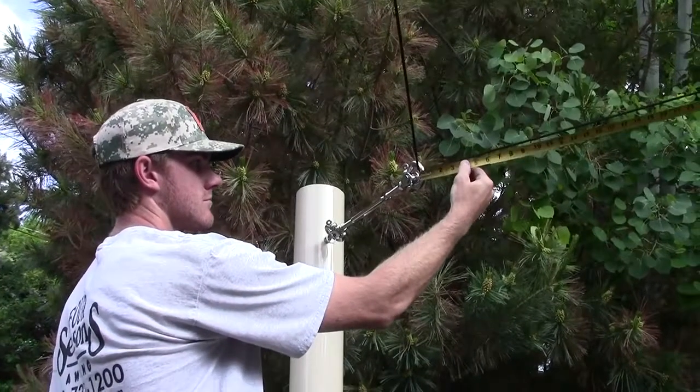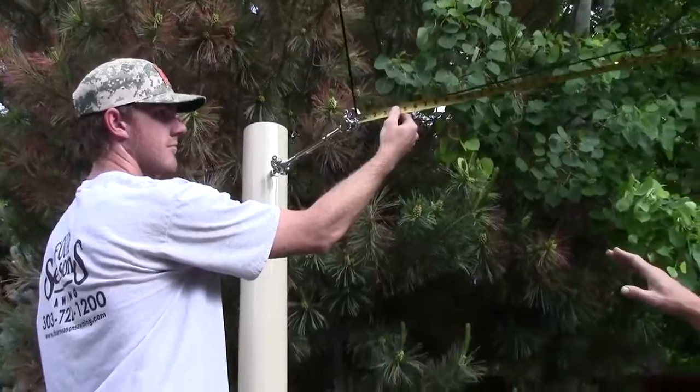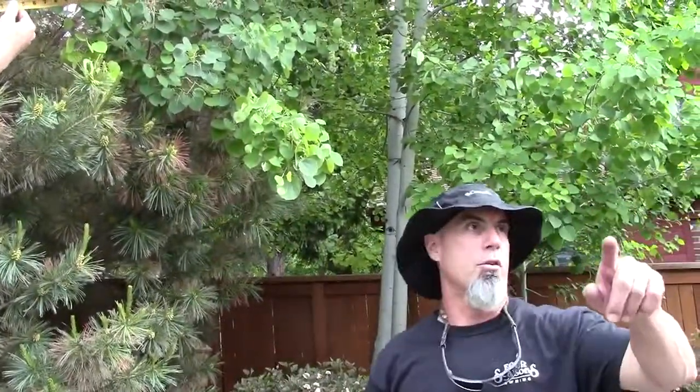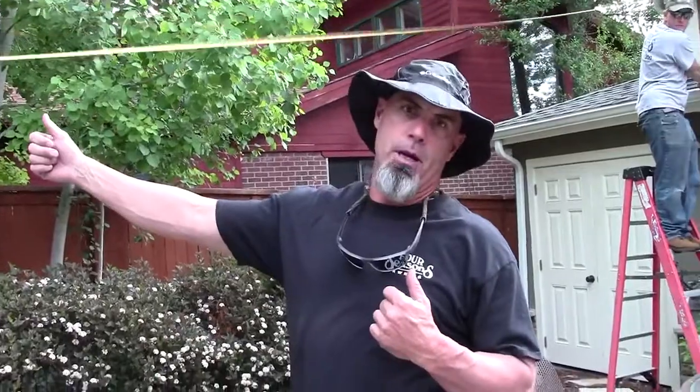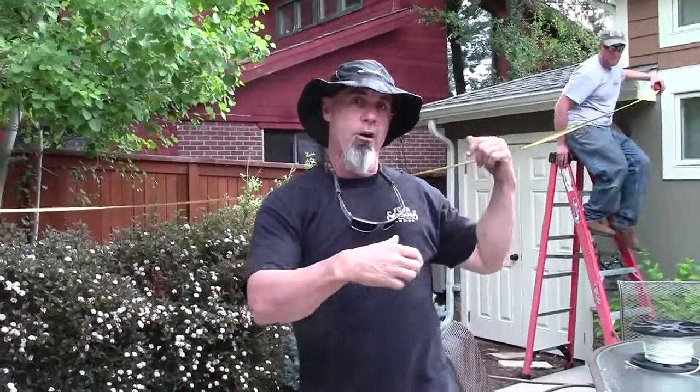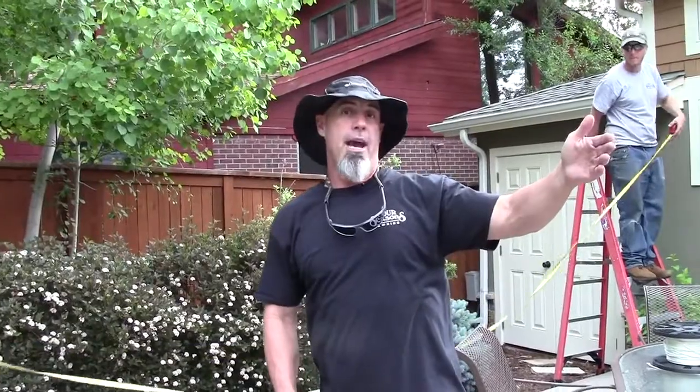All right, so again, you have two options when you're measuring for the shade sails. This particular one here, we have a turnbuckle on all four corners. If you're going to go this route, put your turnbuckles up, string the rope through the shackles, and then you can see where we're basically holding the tape measure, and that's where you're going to measure from point to point. This one here is sloped, so we're only going to need one dimension as far as the diagonal. When you send the dimensions into us, that's how we're going to double check that: we'll take the widths that you provide, all four, and then what you're pulling for a diagonal, we'll put that on the computer, and that's going to tell us how accurate it is.